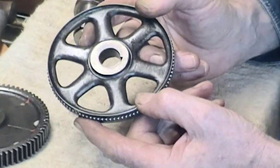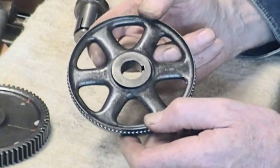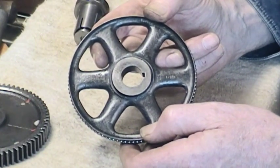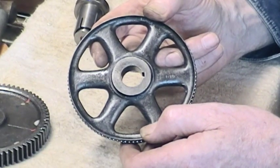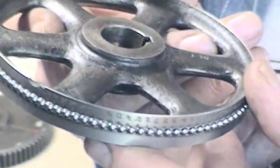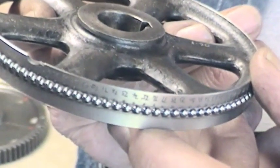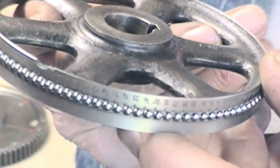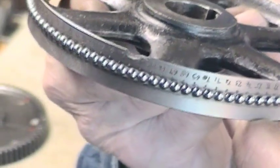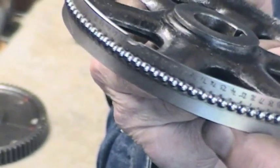Now this wheel is a little more interesting. I wanted to divide by a hundred for scribing a scale on lead screw collars — something to give me a hundredth-type division. So what I did was machine all the teeth off — you can see the numbers I engraved on this one — did the math, took all the teeth off, put in a groove, then calculated what size ball bearings I needed to get exactly a hundred. That was quite a game getting sorted out. So these are embedded in epoxy in the groove.